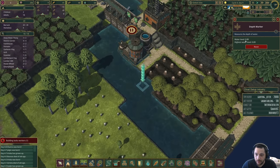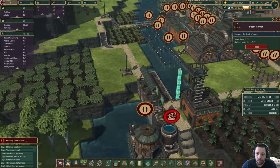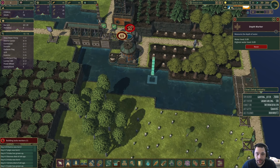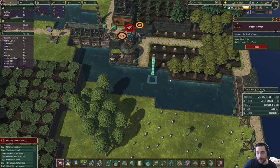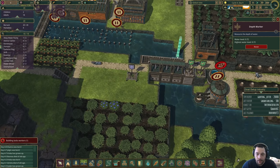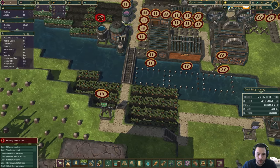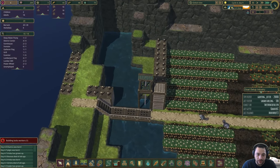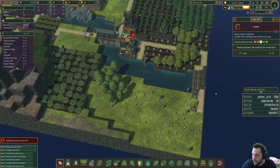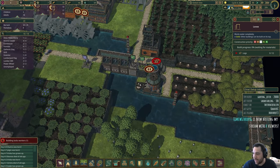The water level here is 0.89 out of 1, and the water level here is 0.72 out of 1. Because we have the deep water pump, you can see the difference — this one's staying up much higher. This was a nine-day drought and we haven't used any water from this reservoir. We've lost about 10% water in two and a half days. Deep water evaporates slower than wide shallow water because evaporation is from surface area, not total volume. Flooding a large shallow area is not that great an idea.